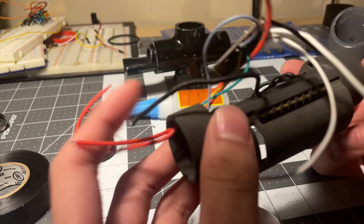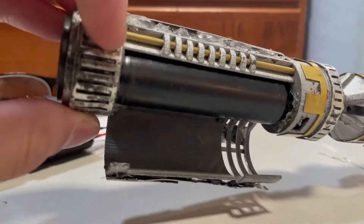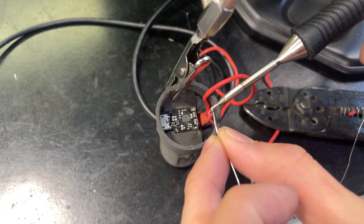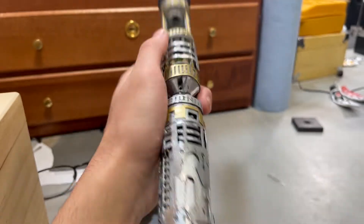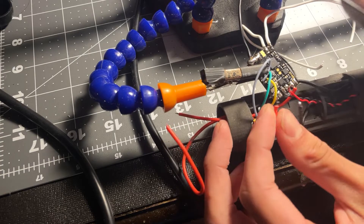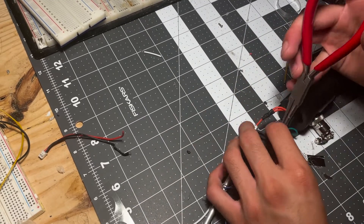As for the electronics, most of them came from the custom saber shop. The whole thing is powered by an 18650 lithium-ion battery. The soundboard used is called a Golden Harvest, which is accompanied by a seedling circuit that I bought for additional programming and recharging. The speaker is found down here, and all the necessary connections meet at this connector. Soldering all this was a pain in the ass. I'm proud of the fact that there are seven separate wires running throughout the NeoPixel blade unit, and you can barely see two of them.